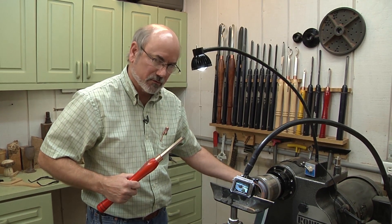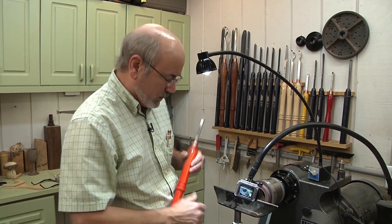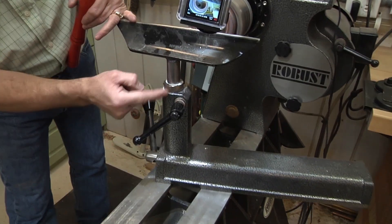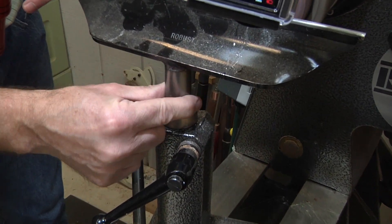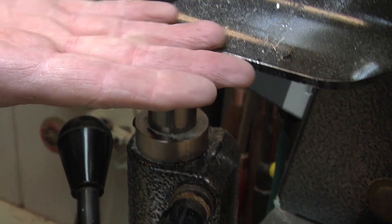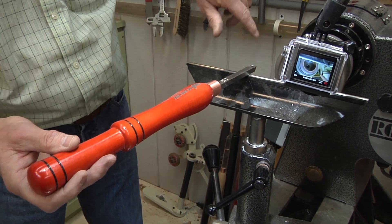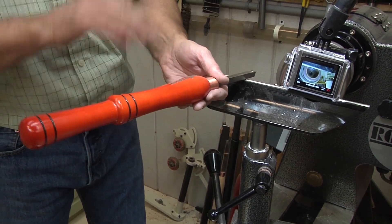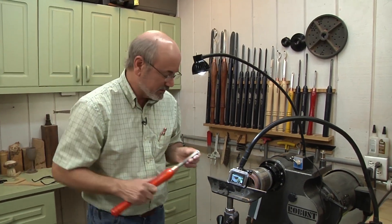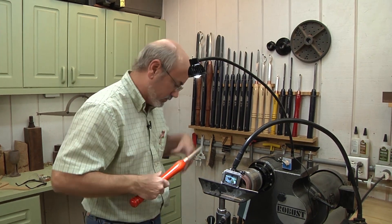It's not real difficult, you just want to be careful and take your time. I'm going to pick the speed up quite a bit. See this little ring I have right here on the shaft of my tool rest? That's a little collet thing - I locked it in, so this is perfectly set. When I present this tool, it's just dead center. As I move around and spin the tool rest, I don't have to worry about the height going up and down and affecting how I present this tool.